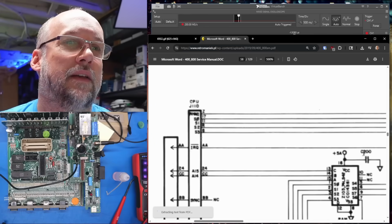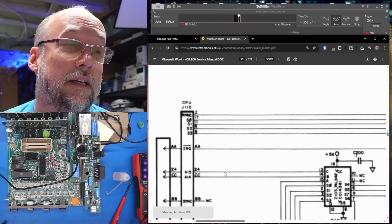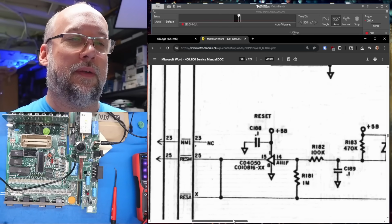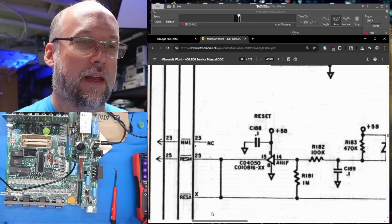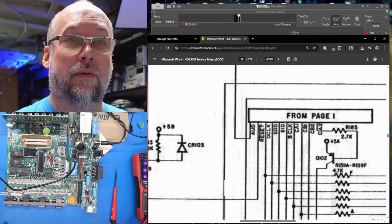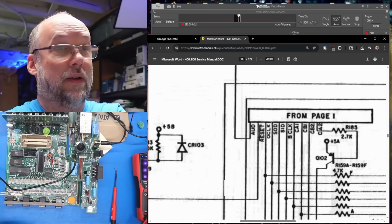Okay, that is as much as I can zoom in. It is blurry. All right, here it is. It's on the second page. Yeah, pin 25, there's the reset circuit for the CPU. There's a little capacitor that charges and a little op amp or whatever that handles the reset. And it looks like the ANTIC reset is just tied together and it probably goes off to the keyboard, which, yeah, I bet you whatever, that connection probably ends up going to the keyboard.